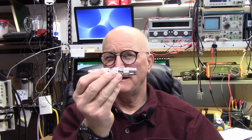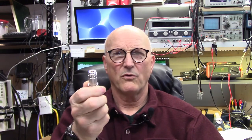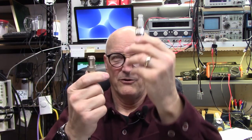As a result, I've decided to change every connector I can between my transmitter and antenna from PL-259/SO-239 UHF connectors to type N — because I don't want to throw away power. What about those frequency limitations people put on UHF connectors? After looking at all the graphs, I have to agree: I wouldn't use these above 100 megahertz. They're fine for HF — 30 MHz, 14 MHz, 3.5 MHz. But anything above 100 megahertz, I wouldn't use them. Type N connectors are more expensive, but they're worth it to get every watt out to your antenna. I'll take the N.